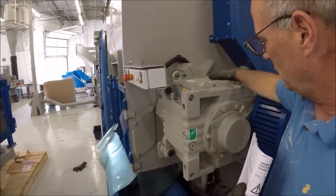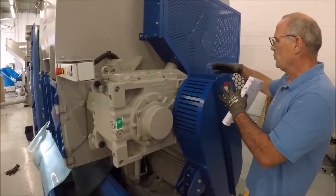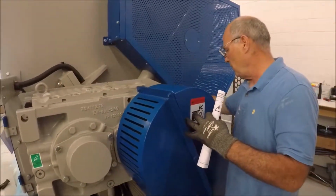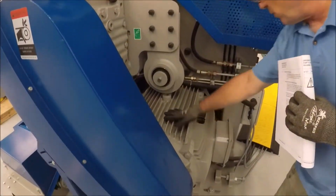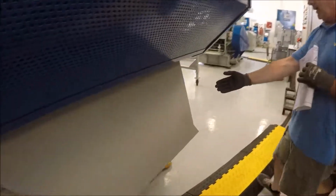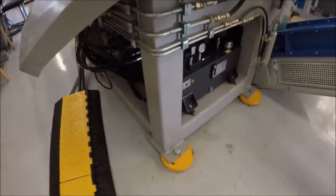all the fluids are in good condition here, making sure you're appropriately greased here, making sure your belts are the appropriate tightness, going around torquing all the key components of it, making sure your shock absorbers are in good condition, grease your motor, and then change your filter and any fluids you may have in your hydraulic system here.